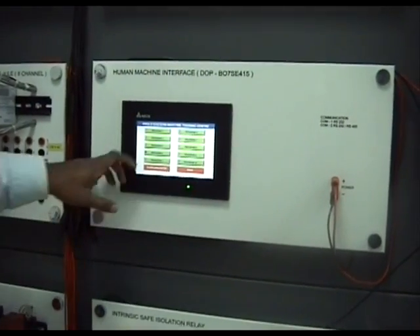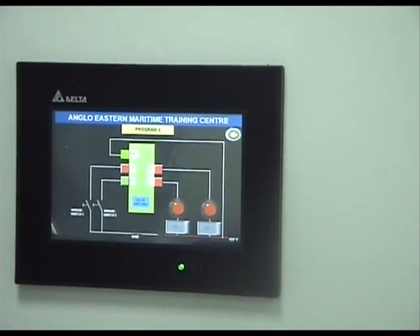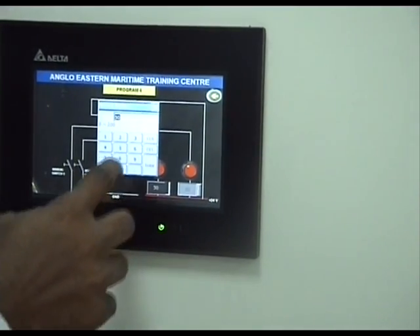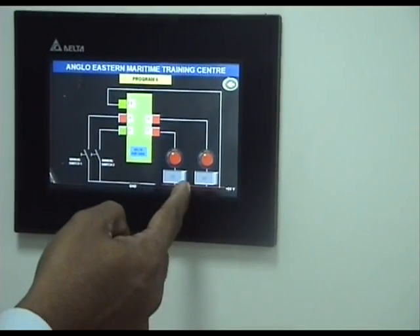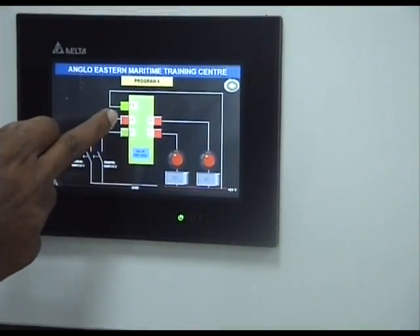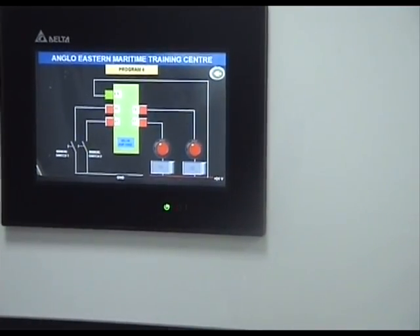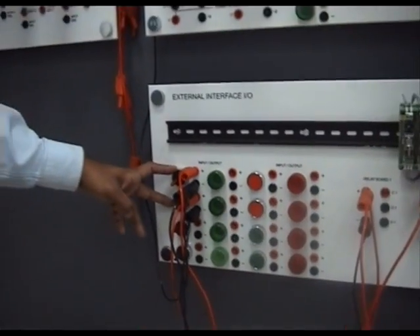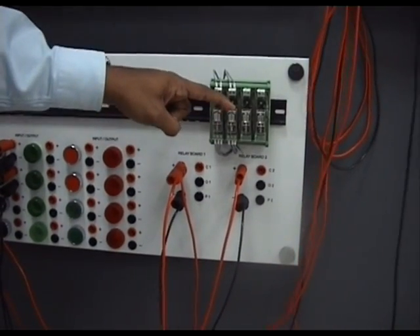We will also examine changing these values to see that the function is altered depending upon which relay leads. This is what exercise 4 is about — the off-delay function of a PLC timer driving two relays R1 and R2. We choose the function from the HMI. Here I am setting one to 50 and the other to 80, which means 5 seconds and 8 seconds. We can see the Y0 output, Y1 output, X0 input, and X1 input.